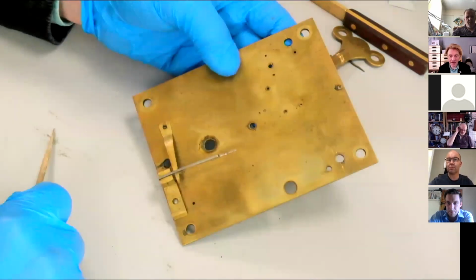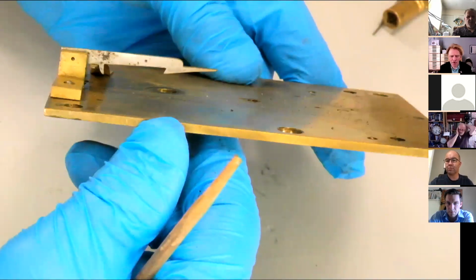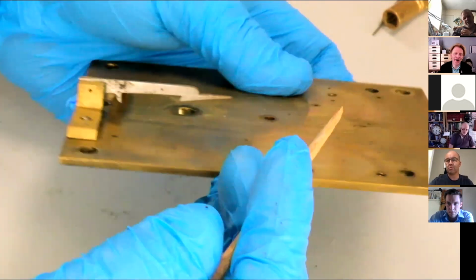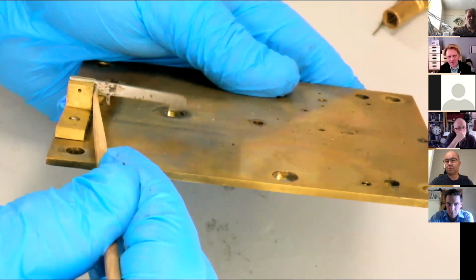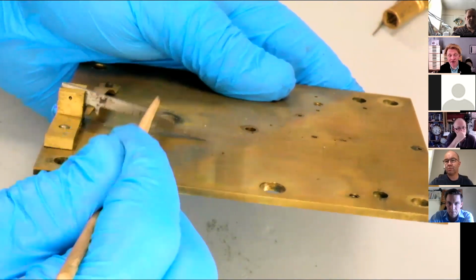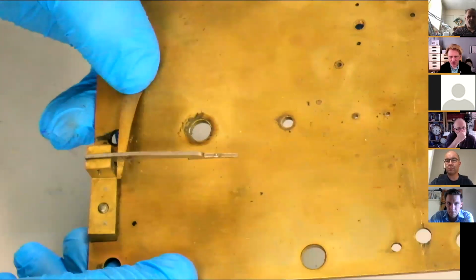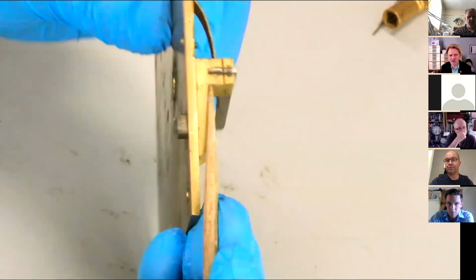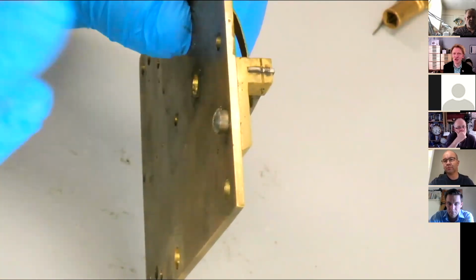Okay, let's have a little look at this for people who've not seen this arrangement before. Here's our Fusee stop iron. There are, let's call it, four elements to this. One is the bit where the spring keeps it out of the path of the stop piece that's on the front of the cone, screwed onto the plate, quite straightforward. One is the pivot point here. These are often marked across by the maker. You can see there's a saw mark there. If you've got a striking clock or a three-train clock, one will have one strike across, one will have two, and one will have three, so you can't get it mixed up.